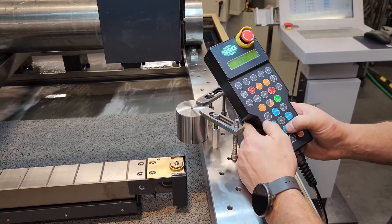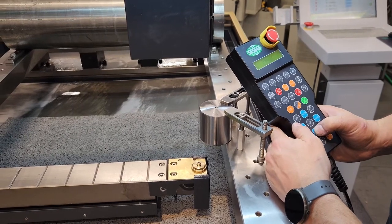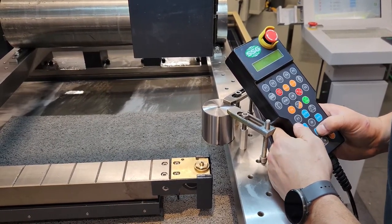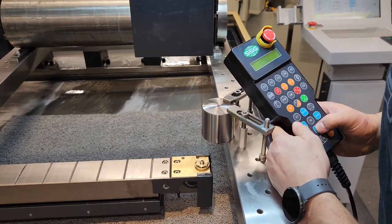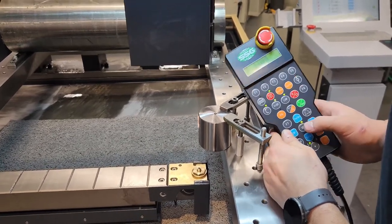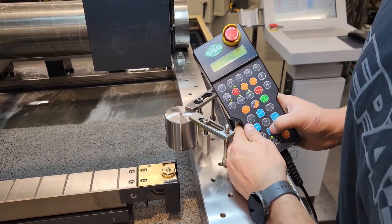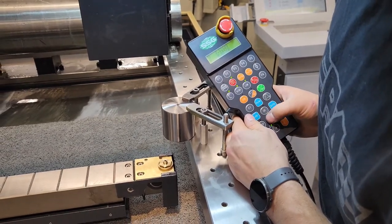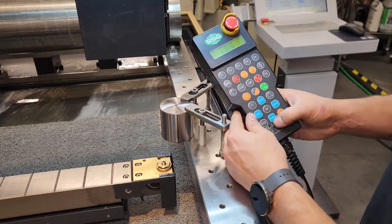I always go over and do one more check that we are straight up and down on our Y-axis. A little bit heavy on top, so I'm going to turn my UV on and walk it away, then walk the whole axis in. Hitting right in the middle — we're pretty straight. We're going to call that good.